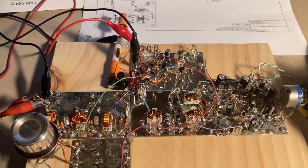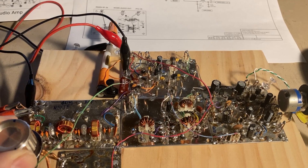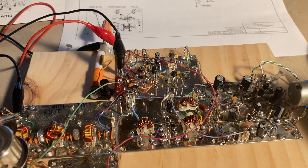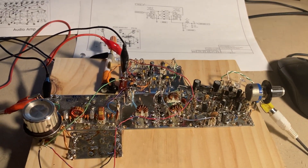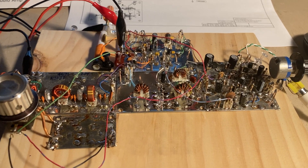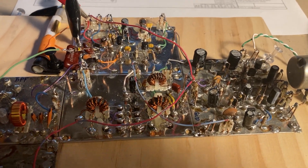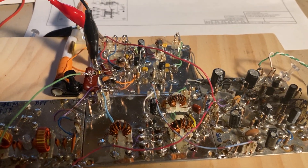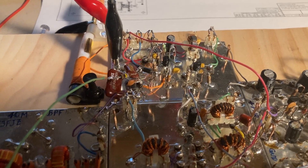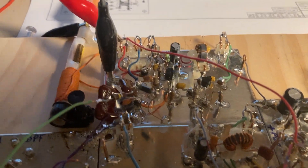I have Chris and I have Al. There was somebody else in there too — Dragon. Okay, well it's definitely picking up signals and there you have it. I'm going to complete the other two modules. And from the fact that you could hear a hum, that is a malady that plagues direct conversion receivers. Essentially what's happening is the PTO is exposed — it's not shielded.